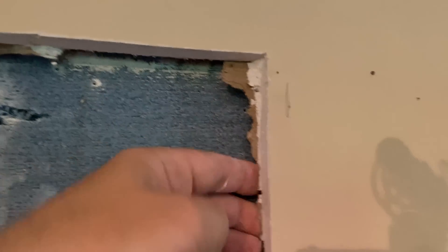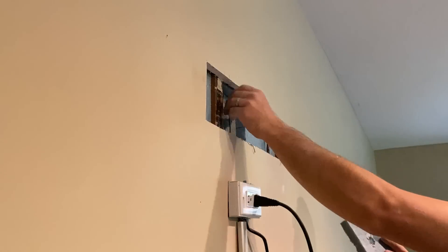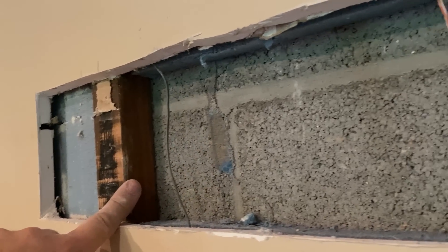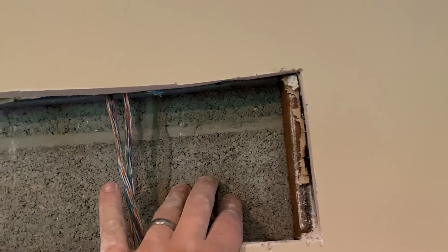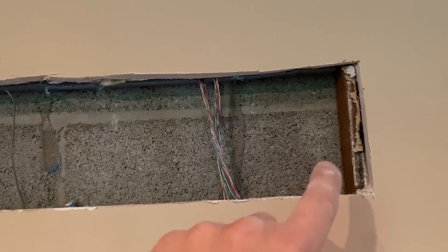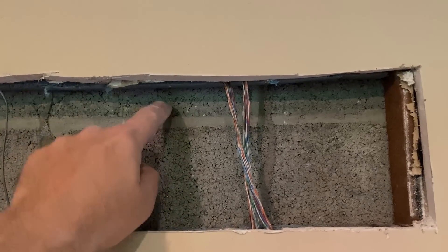What if there's another one somewhere? Concrete. So this is what we have: basically a two by four on edge — I just ripped it down and it's about an inch and a half deep. Then we've got the drywall here, which looks thicker than half inch, so I'll have to figure that out. Some foam board and then the concrete or block wall. What I'll have to do is just grab some two by fours and run them in here — make enough room to run two two by fours between the studs, secure them to the studs, and also run some tap cons into the concrete.